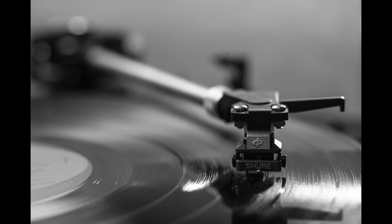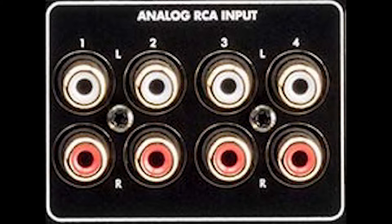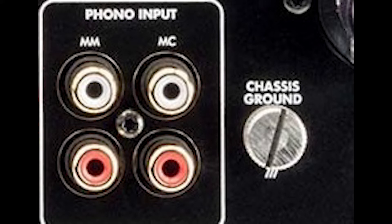The answer to both questions is this: all of the inputs on your stereo, other than your phono preamp, are line-level inputs. A line-level input has a sensitivity of around 250 mV, or about a quarter of a volt — meaning you can feed about a quarter of a volt of audio into it and drive your amplifier into clipping at full volume before you reach full volume on the volume control. The phono input, on the other hand, is much more sensitive, because phono cartridges don't put out a lot of voltage. Your phono input normally only needs about 2.5 mV to drive the amplifier wide open, instead of 250 mV. That's 100 times more sensitive — a 40 dB difference — and 40 dB is a lot.